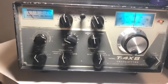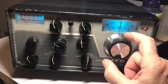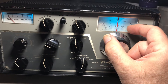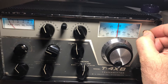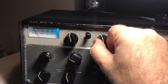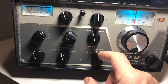I also pulled the entire front panel off, all the knobs off. There's a tiny light below here that lights up when the VFO is in use. I took the panel apart and painstakingly replaced the NE2 bulb under the knob — that took three or four hours. I took all the lexan or mylar dials out, cleaned them with soap and water, made sure the little slider was perfect and easy to operate. The meter switch was easy, all the controls weren't binding, all these knobs got cleaned.